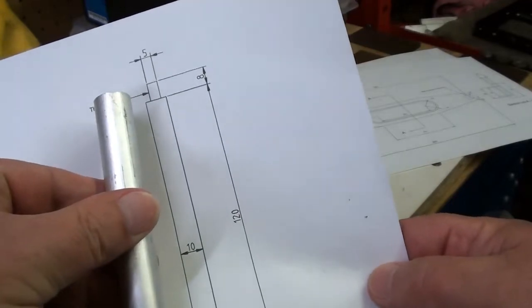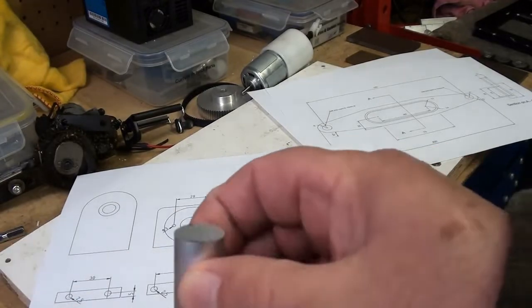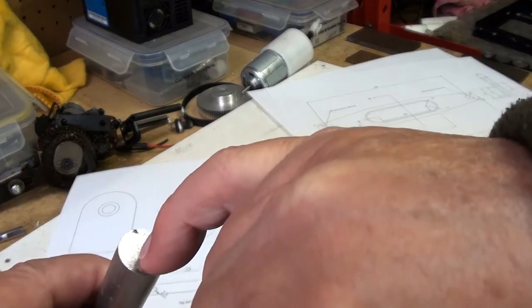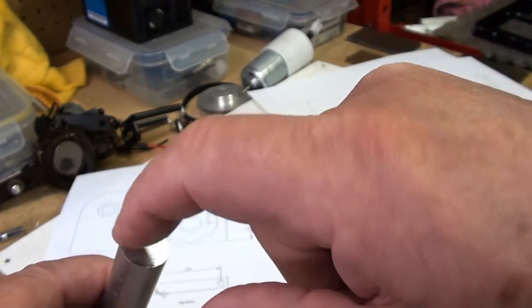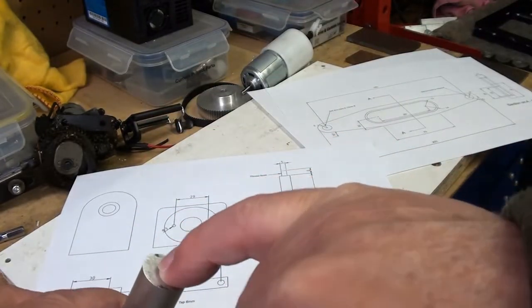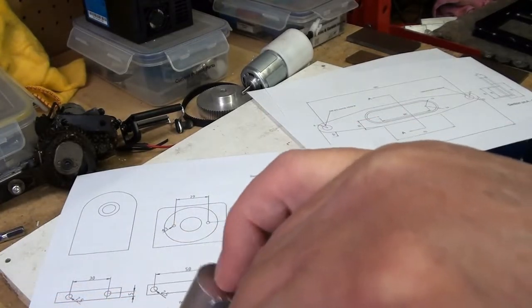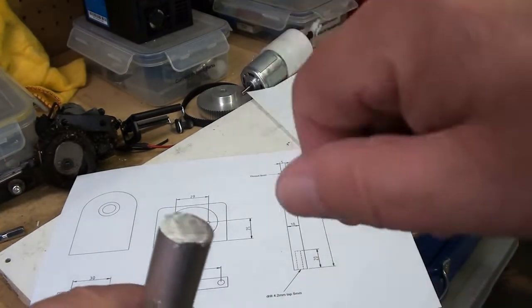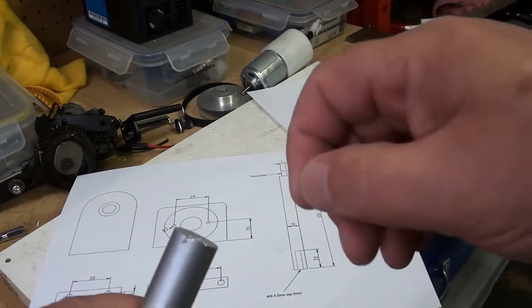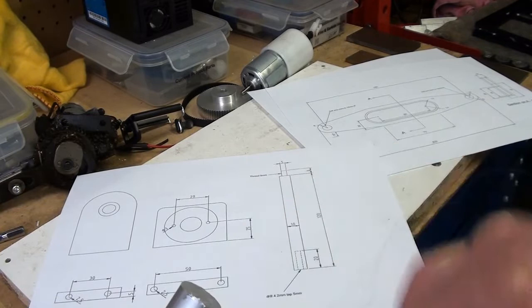as you can see, I'm making them out of 16mm aluminium, and the process will be to face off the end, and then I'm going to cut a little recess in there so there's an annular ring for the column to sit on. This gives it more stability on a flat surface. And then I'll drill and tap both ends, having faced off to length, of course, and done the same thing with the recess. And that'll allow me to screw in some metal, probably bolts actually, and then cut them off to provide thread all the way down to the face and beyond.